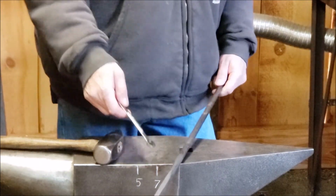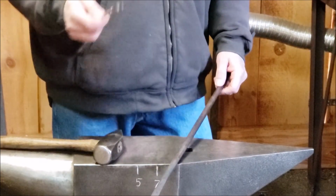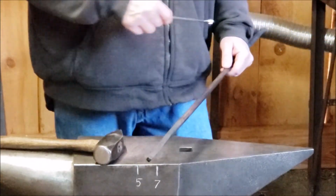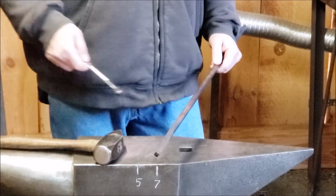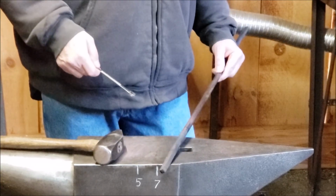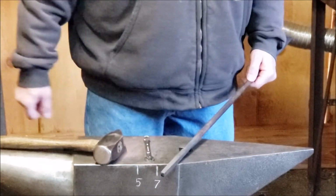So just continue working the bar back, and then once you get close to the halfway mark, just cool it off, turn it around, start on the other side and work your way back to the center again in the other direction. And then before you know it, you'll have a square 3/8 bar. Thanks a lot. See you next week.